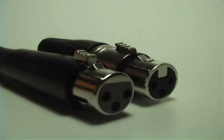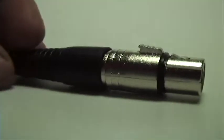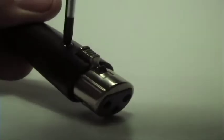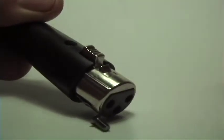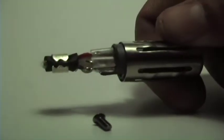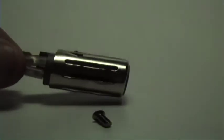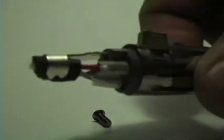We're going to start off by looking at a few different types of connectors. These ones here — we've got one that's low quality and one that's a much higher quality. This one's the better quality connector as you can see. Now we're going to start by looking at the made-in-China connector. We're just going to take this apart by taking out this screw. Now we're going to pull these two parts. As we take them apart, you can see what this one really looks like inside. It's actually made more of plastic with a little bit of tin around the outside. It's very light, and what this one uses for a stress relief is just a little crimp at the end, which typically works pretty decent, but it's only a single stress relief.